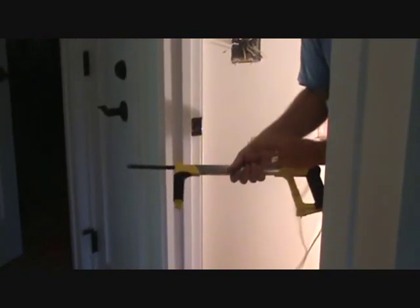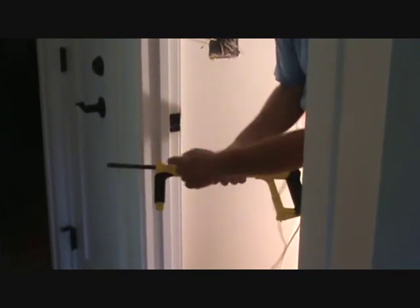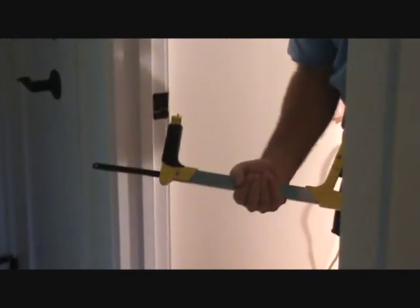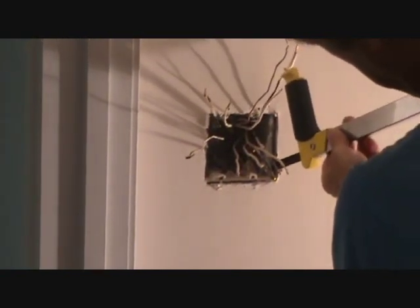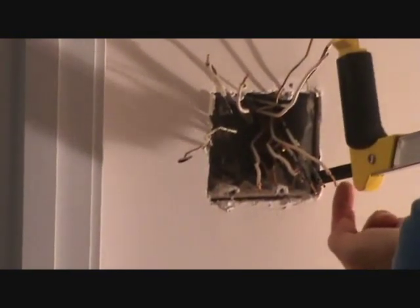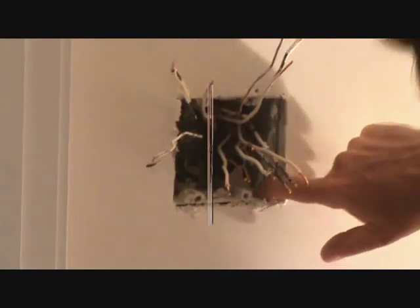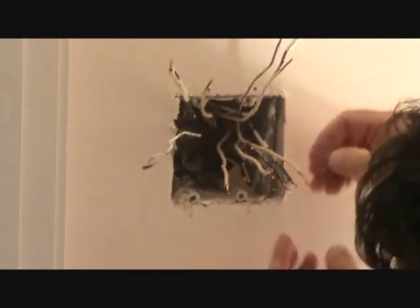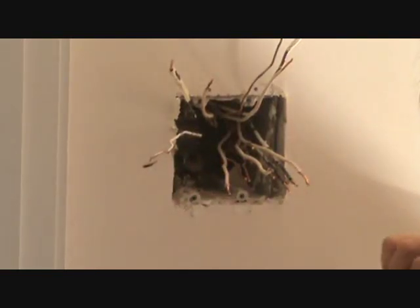I'm going to take this hacksaw and use this. What I like about this hacksaw is the blade usually fits right here — I undid it and there's a little bar inside and I ran the hacksaw blade in here. So I'm going to turn this around and just use this like a little hand saw. I'm going to go in there and cut those nails. Feel the nail, just start sawing it — nice and slow, back and forth. Make sure you've got the hacksaw blade facing the right direction when you put it in. Now I'm going to cut those nails off. It's all loose now, ready to take out. Now I have to fish the box out and push the wires back up in there very gently so I don't mess up the wall. This is kind of tedious and time consuming but just do a little bit at a time and you'll be able to get it.